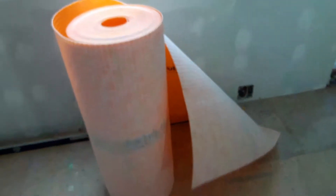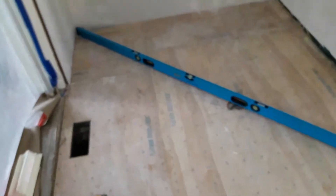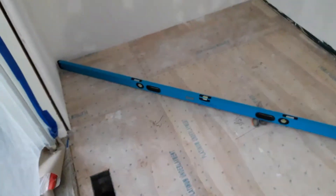We are having good progress with the drywall finishing — the beads are looking great, we have the last coat on things, so our doorways look really nice. We are just about to put our Schluter DITRA membrane down and start tiling. What we've done is try to find the highest point on the floor.